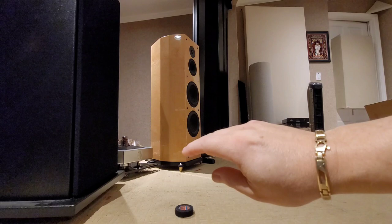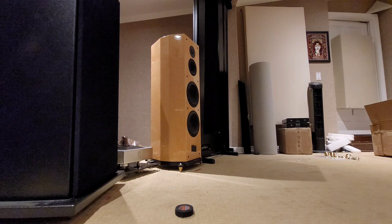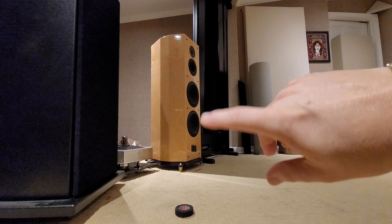The Roland is getting that frequency for the bass. The other channel, the Roland, is getting the mid frequency, and it's much more efficient, way more efficient. Okay, it's also not plagued with phase issues and all the other stuff that passive crossovers get plagued with. So it's a much more pure or audiophile way to go, to use an electronic crossover and actively cross over the amplifiers before.